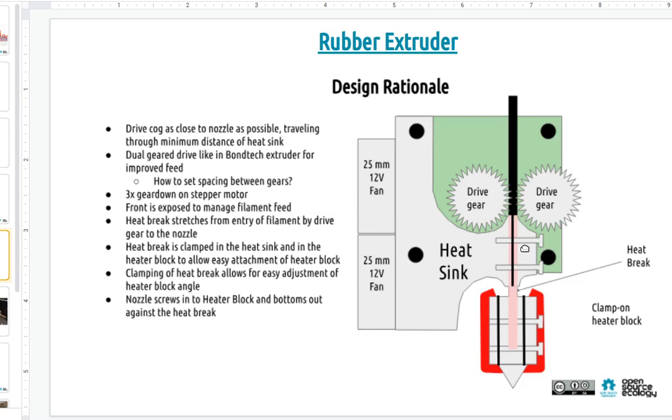Now, the one thing that I'm showing here is based on a conversation with Jehad, the people who make the Jehad extruders, whom I met at the Midwest RepRap Festival. They don't screw in their nozzles; well, they do screw in, but the extruder, they clamp. They use clamping instead of threading because threads are not a good thermal contact. On the hot side, you're trying to heat a thing that's going through the heater block, but it's threaded, so the heat contact is not the best.